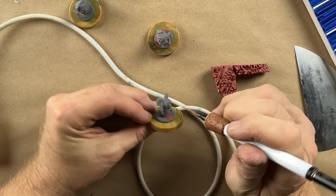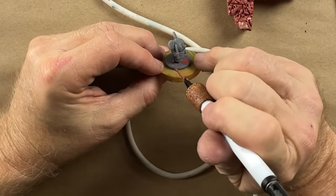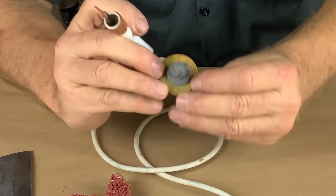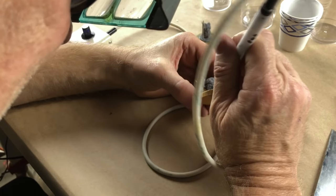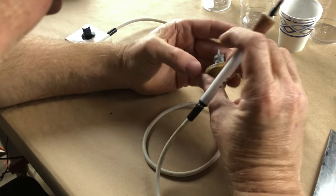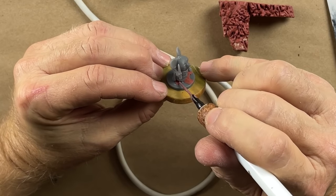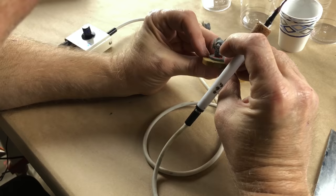There's a giant space between the cape and the feet in the back there — you simply cannot cast things like that. That's a trap that causes the rubber to flow in there and then in the first casting it just breaks off because it's locked into place. As a toy prototype sculptor, this is exactly what I did for a living — look at characters and turn them into objects that could be manufactured. That meant you have to sacrifice detail and design to make things possible.